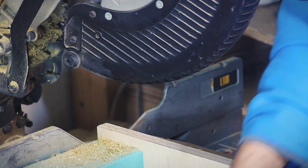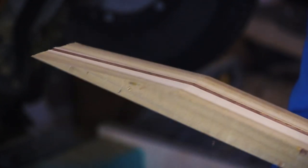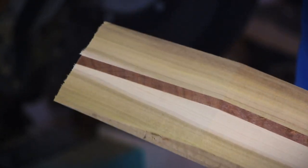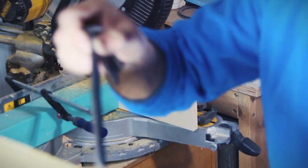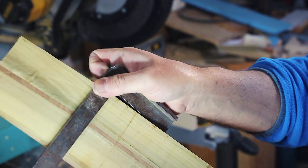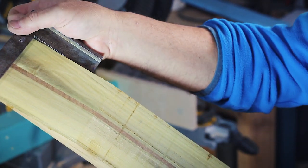If you're cutting the two pieces separately, make sure you have the same angle on both. Avoid any unnecessary pressure or force, which can slightly skew the angle of the blade. The guard may be in the way for smooth continuous cuts, so hold it up and use as little force as possible to lower the blade. Cut a few scrap pieces first to get your technique dialed in. Notice the clean cut a circular saw gives — a bandsaw, especially cutting by eye, will give a more jagged result.